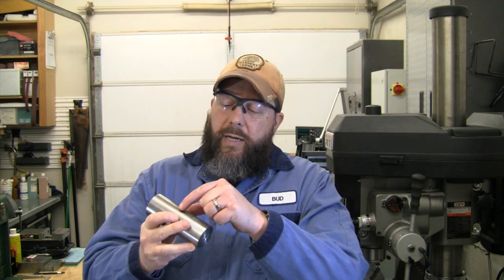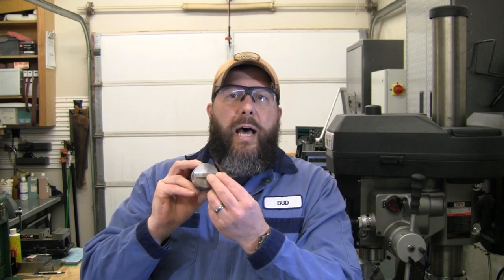We're going to take the stock, turn it down to inch-and-a-half diameter, and then take it over to the mill. We're going to mill a couple of slots so that we have a nice flat, so that we can stick this right into a quick change tool holder — mill away the top and the bottom so that it fits in just like a tool would fit into a tool holder, with the ability to slide back and forth. Then we're going to take it over to the mill and mill a slot in the end of it.